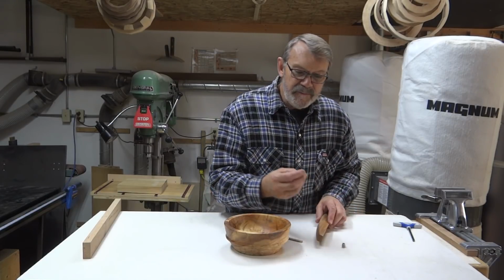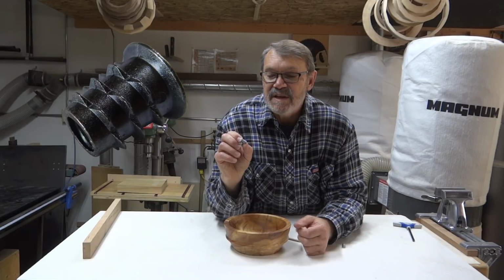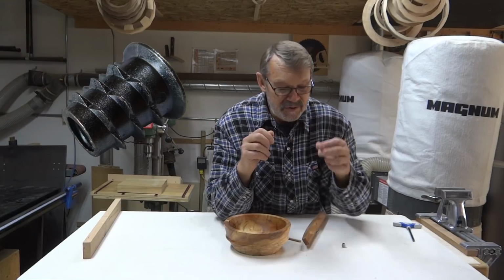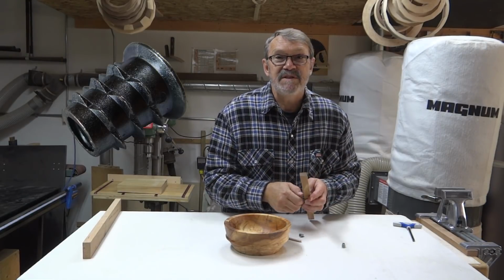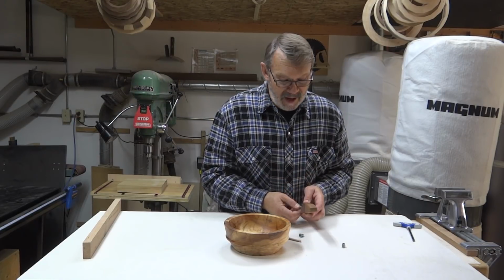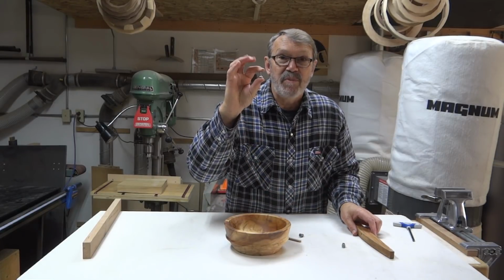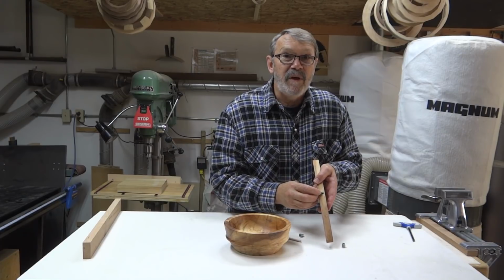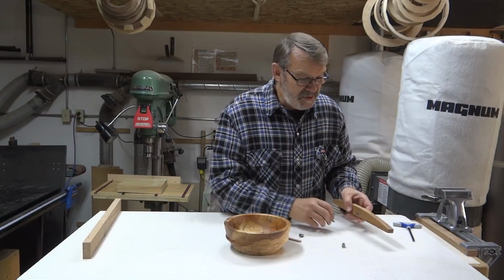Second thing you need is what's called, in this case, a 1/4-20 insert. Now this has very coarse threads on the outside, so it can be turned into a hole in the wood. 21/64 inch, I believe, is the diameter of the hole you use for that. So once that's in there, then you just need a 1/4 inch bolt, long enough to go through there and into the hole that you've drilled for the dowel to go through. That's all there is to it.